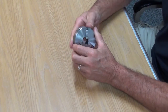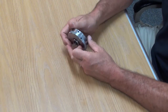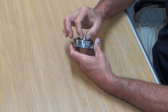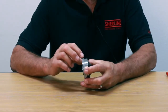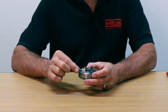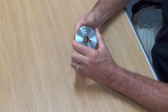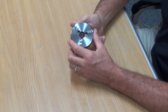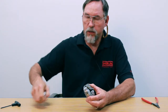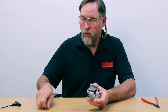To take it out is relatively easy, you just open up your chuck. On the newer chucks we changed the design and it has webbing across the bottom, so the jaw slots are the same width all the way out — very uniform. On the older style chucks that webbing was not there, and you would tend to have one of the three jaw slots that was just a hair tighter than the others. With the new chuck design that's not a problem, and the jaws generally screw out nice and easy.